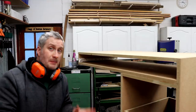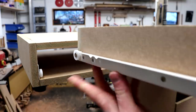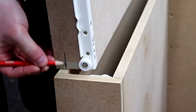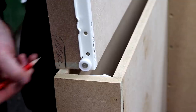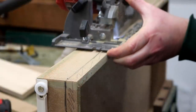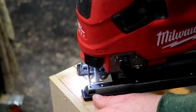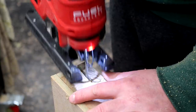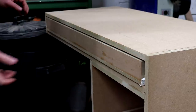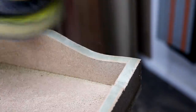I've run into a problem. The issue I was expecting was fitting these runners inside such a shallow space, but actually I got the screws in just fine. The real problem is getting the drawer runner to seat inside the cabinet runner — I need a lot more clearance at the top and really should have thought about that. So I'm going to try removing a bit of material. I made a plunge cut using my circular saw and cut away some height from the back panel of the drawer, then used the jigsaw to cut away material at both ends. I did need to nibble away a little more than expected, but now it fits really nicely. After a bit of sanding it almost looks like these cuts were always supposed to be there.